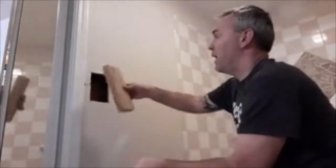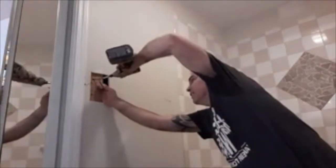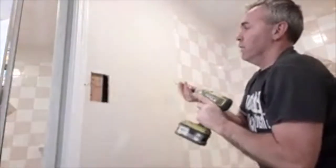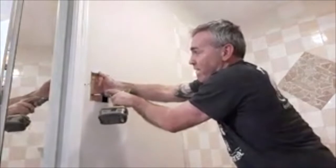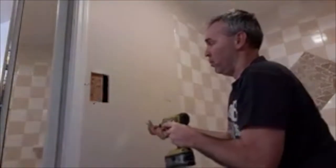So take a block of wood. I made it just slightly bigger than the hole. I have already pre-drilled right here in the wood so that I can go right into the king stud here. King stud holds the trimmer stud, which holds the header, which you can put on the other side. So if you did not have any wood there, you could also just hold the block in the wall and just go through the drywall like this to hold a board in place.